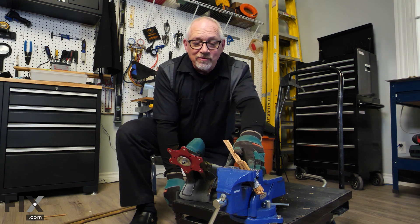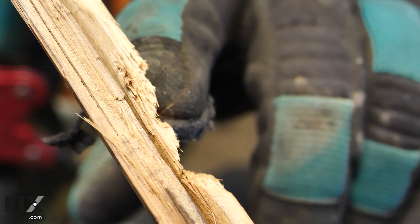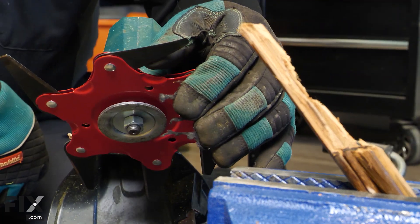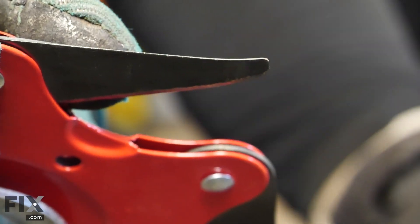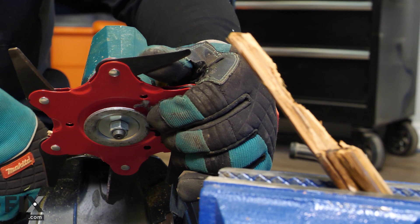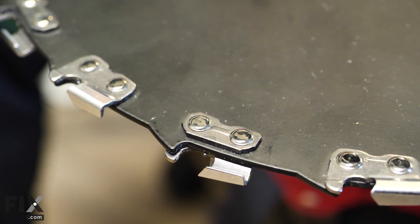It started to chew through these pieces, but I stopped the test because the shaft was feeling like there was a wobble — something was out of balance. When I stopped and took a look at the blade, you can see the tips were actually starting to bend, throwing it out of balance. So it could cut it, but it was just a little overwhelmed.